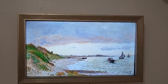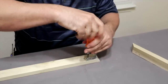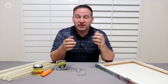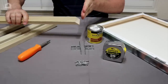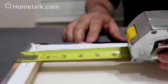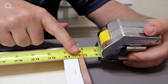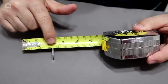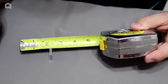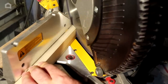I hope this inspired you to build your own DIY television frame. I just got our family portrait in and I want to build a floating frame for it. I wanted miter cuts on my frame — you can make yours flat if you want. The way I measured was I went ahead and measured the length of the frame, got to 32 inches, and I added 1/8 inch for the width of each corner brace, so that's a total of a quarter inch. I would measure and cut my length on my miter at 32 and a quarter inches.